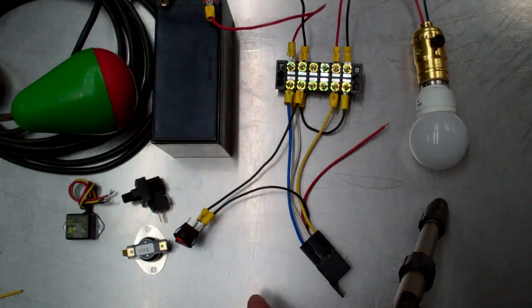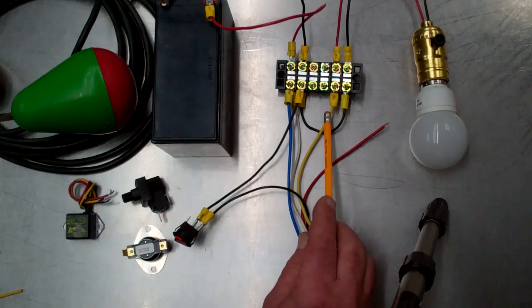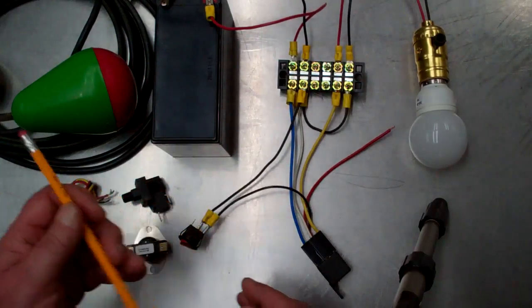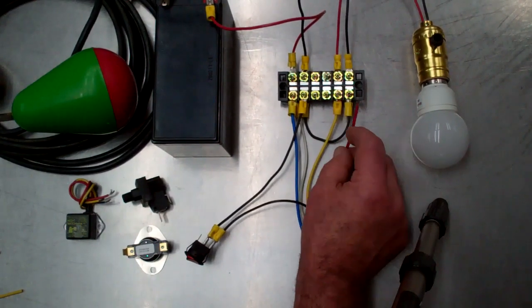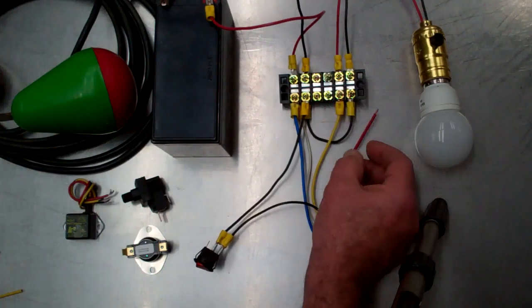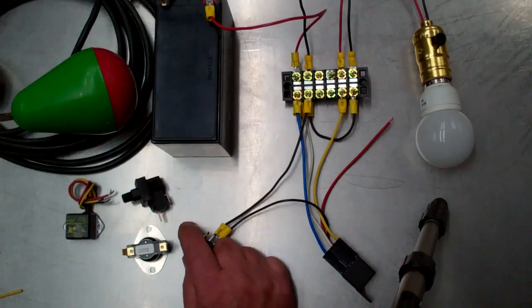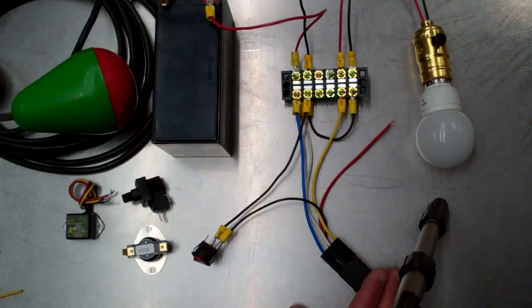The way the relay works: we talked about having the common wire, which is the blue wire. The blue wire, depending on whether the relay is open or closed, is feeding the yellow wire. When the circuit is closed you can also use the relay in the opposite mode, so that when the coil is open you have current flowing. The relay can be used either way — using the switch to turn a load off or using the switch to turn a load on. The least energy state is the way we have it presently, which is important for off-grid solar applications.